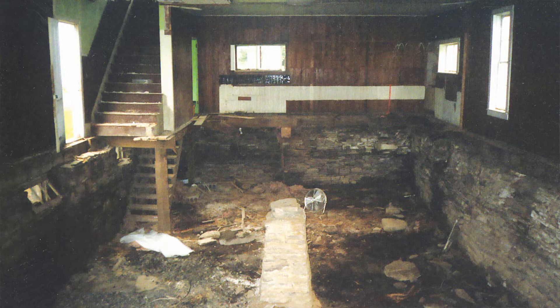The first thing done was the hardwood floor upstairs was torn up, then the subfloor, which was original to the building, and then all of the original floor joists. I remember when we first had an architect and contractors looking at what was in existence — an engineer who came took a screwdriver and jammed it into each floor joist to determine which were in good shape. I believe almost every floor joist throughout the whole first floor, you could jam a screwdriver through it.